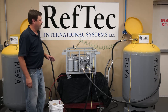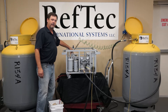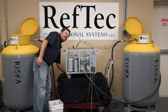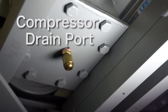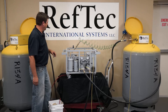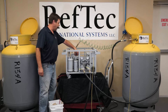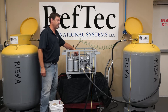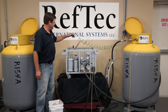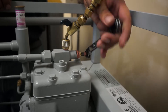The process is simple. We're going to use air or nitrogen through the discharge of the compressor, and we're going to pull the oil out of the drain port on the bottom of the compressor, as well as the drain port on the bottom of the oil separator. We'll do the compressor first. We want to open up the equalization valve between the outlet and the inlet port, and have our hose-evac switch in normal mode. With everything hooked up, we will apply air or nitrogen to the compressor. We will then use a service wrench to open up this valve three small turns.